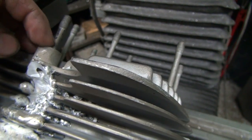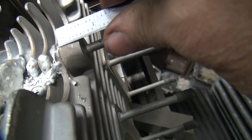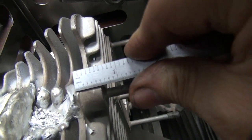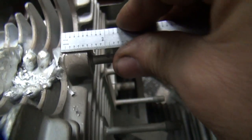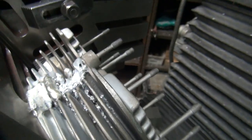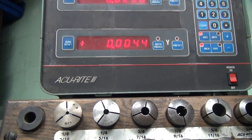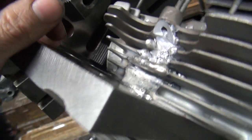I don't want to weaken this boss too much — when you pull the stud off here, the more valve spring pressure and the higher the RPM, the more you try to rip this thing off the bike. I have done that on my Sportster. It looks like I'm at about 580 — I cut a little bit more than I wanted to. So I'm going to leave it at that because I only want to go to maybe 600. We've got this at zero right now. I'm going to back this off about 5 and re-zero it. That's close enough. And we've still got our negative 25 in there. So now I'm going to go ahead and plunge this down here.